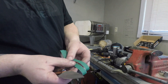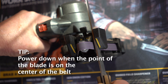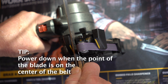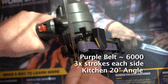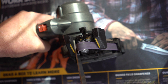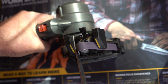Where this is really abrasive, that's great for certain knives, but if you're just sharpening a kitchen knife, you don't need to use something like this. A lot of times you could come back to just the strop and just retouch the edge. Kind of like when you see barbers — they'll have that leather strop and they'll run the razor down it. That's keeping the razor sharp all day long. So if you take care of your edge with the higher grit belts, you won't have to go back to the lower grit belts and restructure the edge.